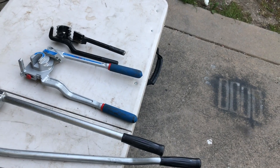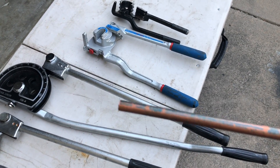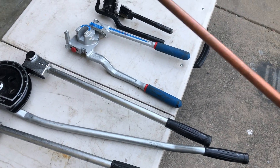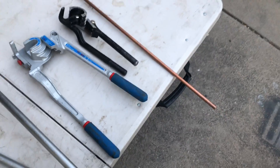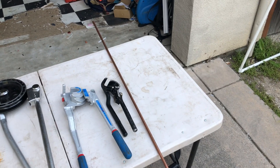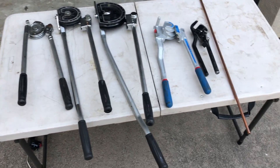I don't know if there's anything left on this one we can read — it's a scrap piece. It comes nitrogenized. It's a hard-drawn pipe. If you bend it without annealing it, it will kink. So I'm going to show you what I do when I anneal it and some tricks and tips on how I bend it.